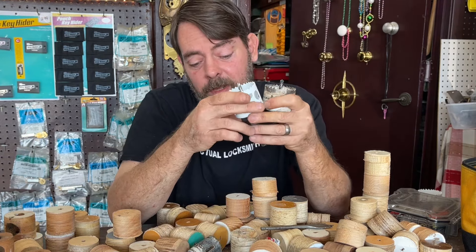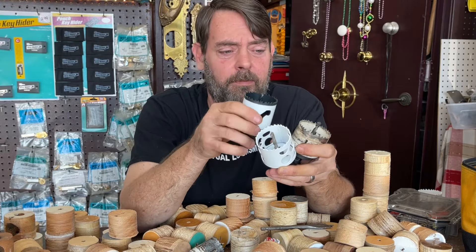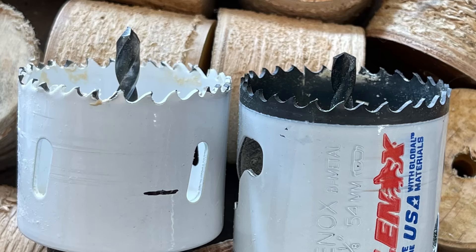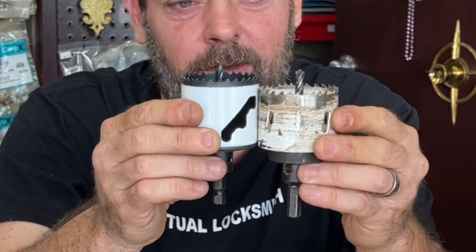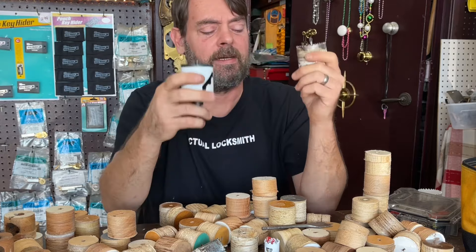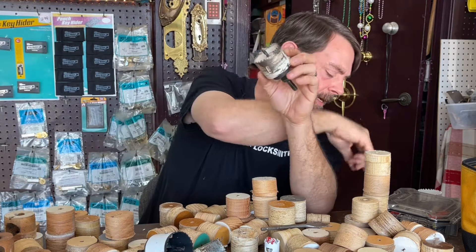The regular Hole Dozers have held up really well, and I was really hesitant about that tooth pattern. Comparing the Lennox bit tooth pattern to the Drill Hog bit — it's pretty much identical, it could almost be the same thing. Now to the bad part: the biggest issue with the two and one-eighth inch Drill Hog bit is that it's quite a bit shallower than all the others. There's literally one thing that a two and one-eighth inch bit is used for anywhere, and that's door locks. Two and one-eighth inch has been the standard since the '70s and '80s era. So why make a bit that's shorter?